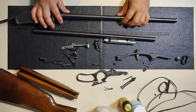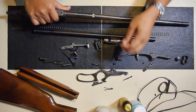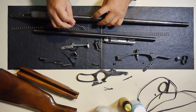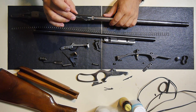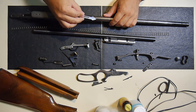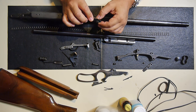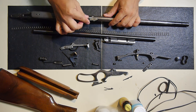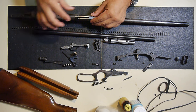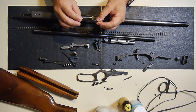I've been inspecting all the parts and went ahead and took the rear side off — that was probably the spot with the most rust. I took it out to the shop, took a pin and put it up against this side. This side had a flat on it already, so I figured it would be easier to push it out this way. I put it on a well-padded vise, took a pin, and gently knocked it out of there.